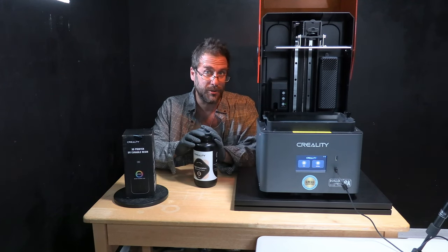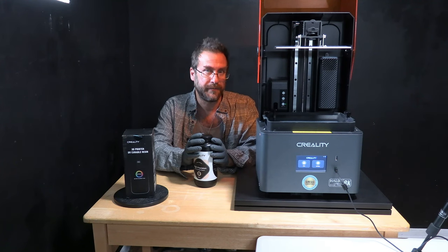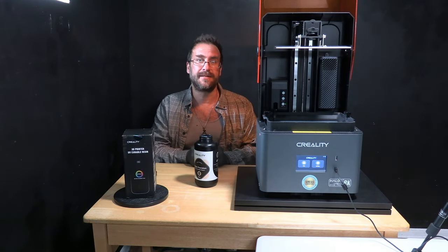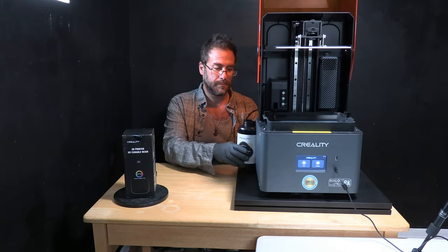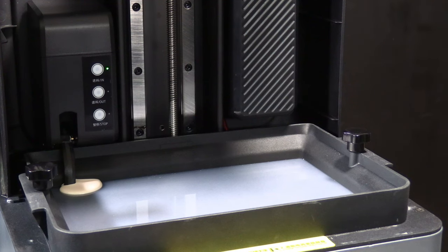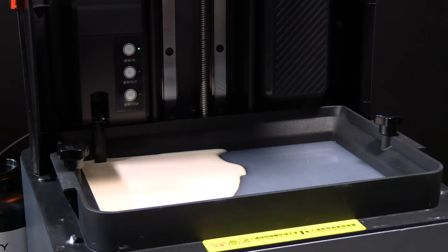I would rather have it protected with only a small opening for the tube. This would avoid contamination from your environment getting into your resin vat and working its way into your print. I will be looking for a pre-existing solution or coming up with a solution of my own, and we will talk about that in the very near future. For now, let's open this bottle again and test the resin feed system to fill the vat. The first thing you are going to do is put the hose into the bottle. With the hose in the bottle, I am going to manually feed the vat by pressing the in button on the printer. Boy, is it slow. However, it's working, so I won't complain.